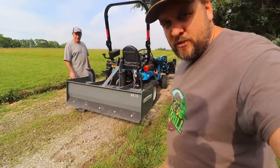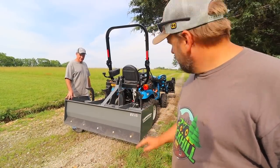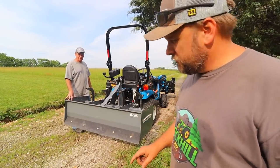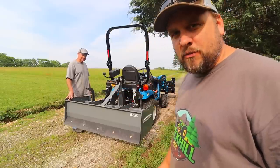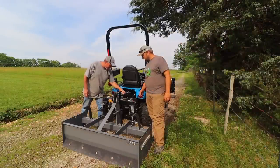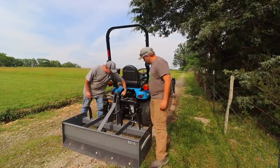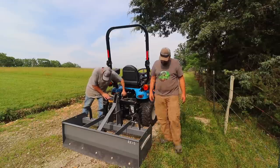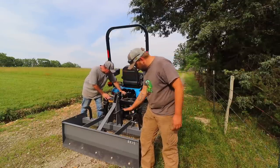It pulled it just fine, and I was rolling material in there, but it wasn't really cutting that grass off. So I think the first thing we're going to do is just angle the blade forward just a little bit, try to get the bite harder. Because that was the first thing I thought when I got on it — it's putting more pressure on the back cutting edge than the front one. Just now to level, I think, as far as forward and back.